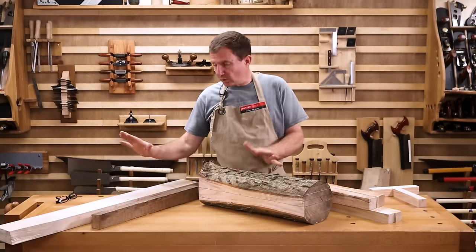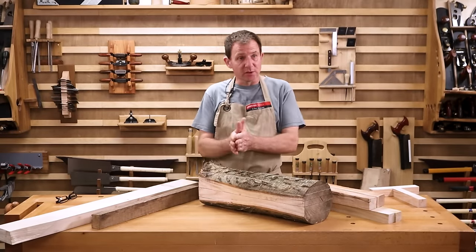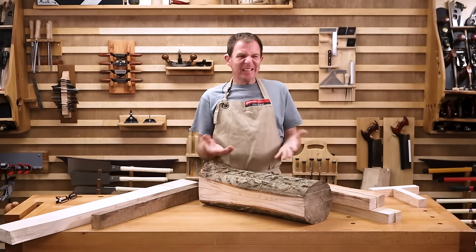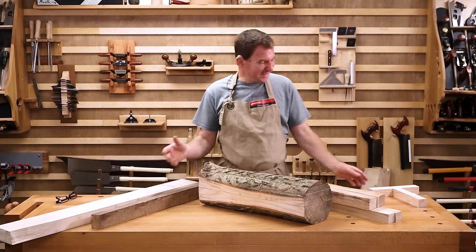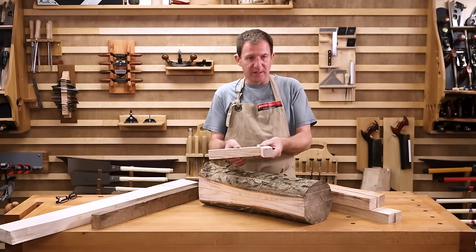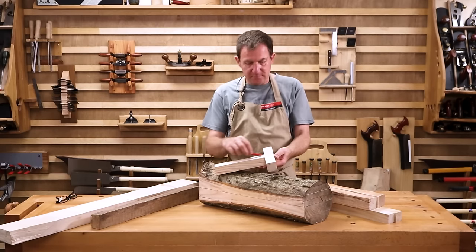Okay, with our timber, we've got a piece of sycamore, we've got a piece of oak. We're going to hand plane those so they will actually joint together, they're square, they're flat. Is that important? Can you not just go with your wood and just glue it up? Ideally, if you want to make anything with a joint or anything, everything needs to be flat, so the surfaces will line up nice and smoothly.